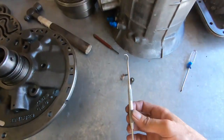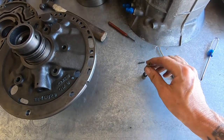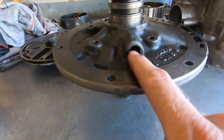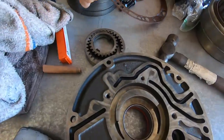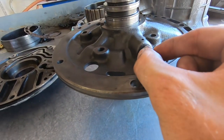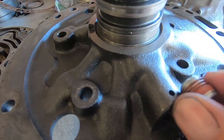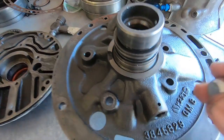Bam — piston, disassembled. This goes in, spring rides against it, pin holds it all together. This pin is just a little roll pin — hollow — and they break. People do solid pins and all kinds of things, but the best way is to tap this hole right here, make sure the threads go past this portion so you can bottom out the threads. The plug needs to cover that hole so there's no pressure loss, and it needs to bottom out past the roll pin hole. We thread this guy in and we should be good to go.